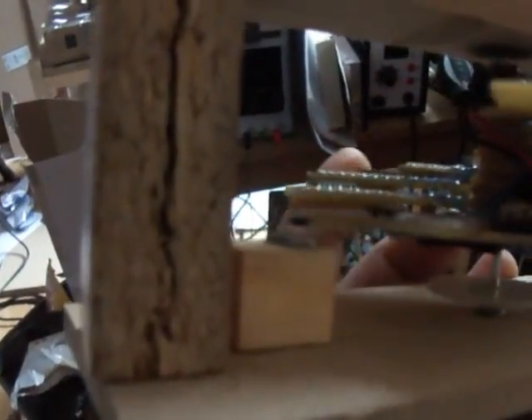And this is synchronised with its spin by a magnetic sensor. So every time the board spins it passes this magnet, and that tells it where the start of the rotation is. And that starts up the counting in the interrupt handler inside the code, which then tries to trace out a stable pattern in the air.